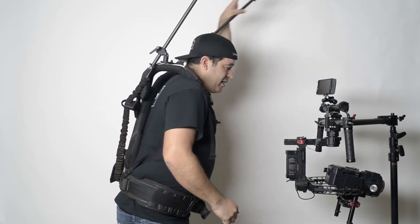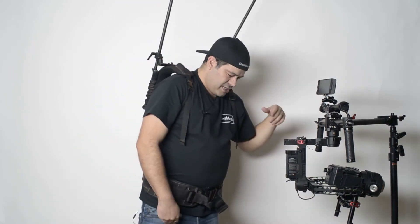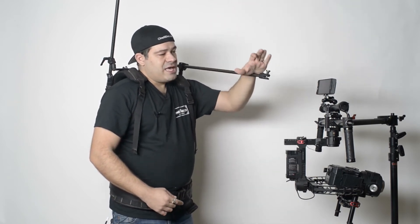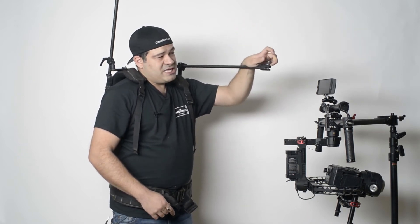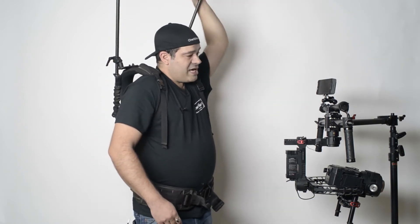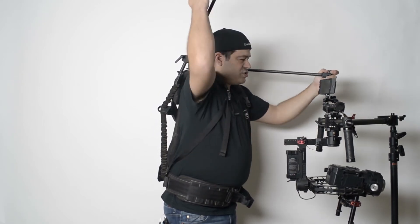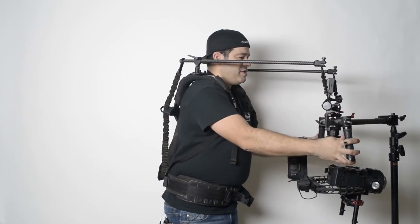You can bow a little bit, but the technique here is to overhand it: go from the outside and use your wrist to pull down on the rod. That leaves your other hand free to pull up on the release pin. Go from the outside, pull the rod down, pull up on the pin, slide the clip in, and make sure it's closed. Do the same on the other side — and then you're ready to pick up.